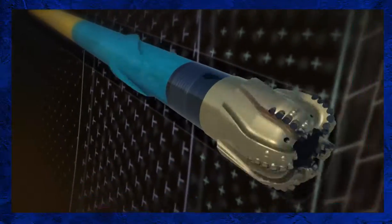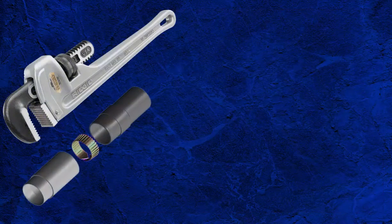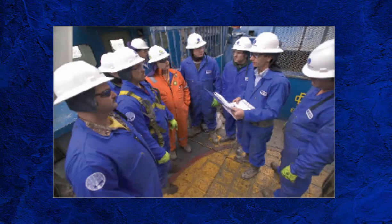The next big event is to assemble the core barrel and run in hole to start coring. Prior to lifting barrel sections to the drill floor, the core crew must ensure all necessary handling tools — the bit breaker, chain tongs, and core head — are lifted to the rig floor. Ensure the lifting subs are chain tong tight and all joint connections are marked with a wide chalk mark. Before beginning operations, a thorough toolbox talk must be held, as coring is an infrequent operation and the drill crew may never have seen a coring operation before.